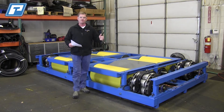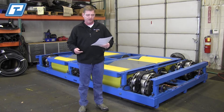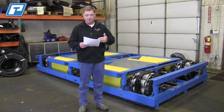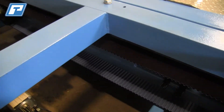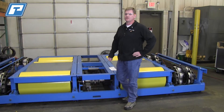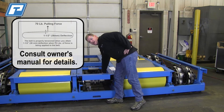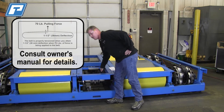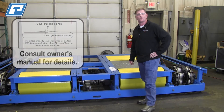After you do your monthlies for five months in a row, you're going to move up to your six month preventive maintenance. Six month preventive maintenance includes all your monthly items plus the inclusion of verifying your belt. Your belt is centrally located in your chassis dyno. At least every six months, verify that your belt is in good operating order — it should have some bounce to it, but verify that there's no barb sticking out of it, no stray wires, no cracks or broken material.